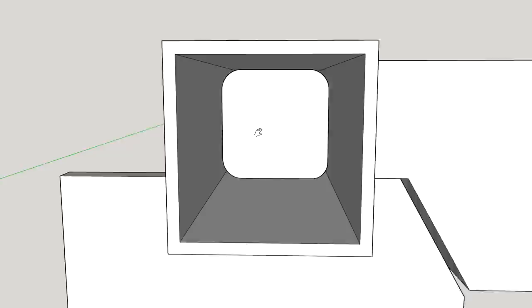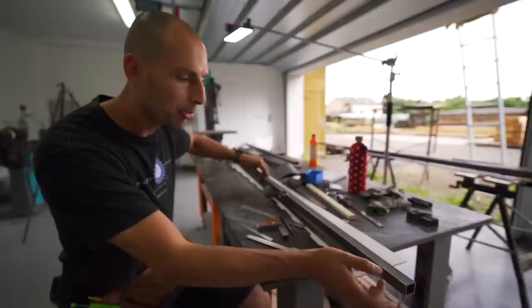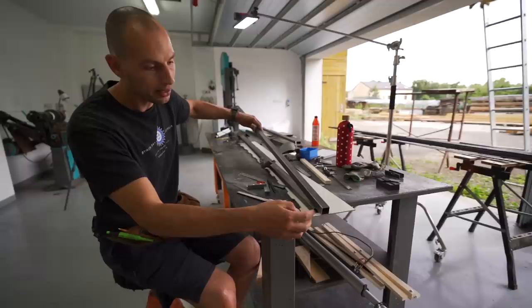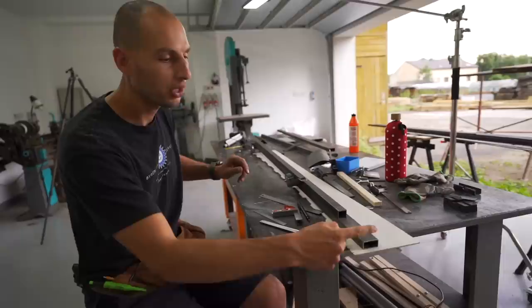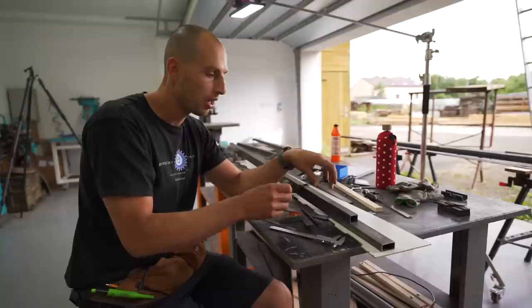This is easily one of the toughest parts of the solar rack. This, because that's tricky. I'm thinking this needs to be a mechanism that is capable of sliding 16 mil. At the same time, it needs to be able to rotate. And at the same time, nothing can be in its way right here. See? Nothing below this level can be happening because essentially it goes like this. So I'm thinking routering out a groove here, 8 millimeters, and then having one pin axle here and here that would go like this. And then inside of this, I would make a sliding part and just screw to it. That I think could support it and could actually do the job.